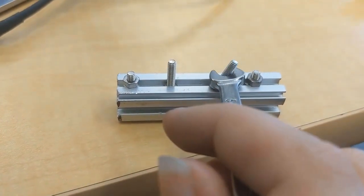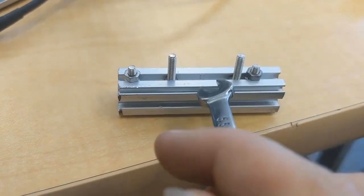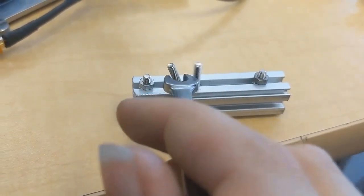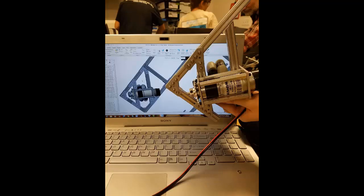There are a few complications with using REV. After the screws are placed in a channel, there's no way to access the central screws, which means that you need to know a good amount of your design before you start to build. We recommend you use CAD software to plan your design before you begin. You can use a drill bit to pry a hole into the channel and access the center that way, but we prefer not to do this because you can't put a screw there ever again.